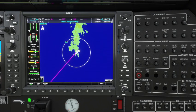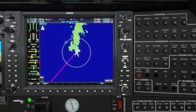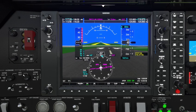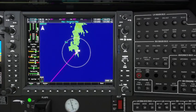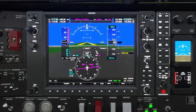It does its checks on the left engine, kind of like a run-up in a prop airplane, a conventional, non-FADEC airplane. So that's how it does it, and these messages will appear during that. Then once it's done its test, let the button out, and same for the other engine. Hold that in, or EEC fail. Then you can see it run itself up here. Same in a prop where you run the prop lever, high RPM, low RPM, and adjust the RPM with a throttle. So same idea, it's just a FADEC computerized way of doing it. So okay, that all looks good.